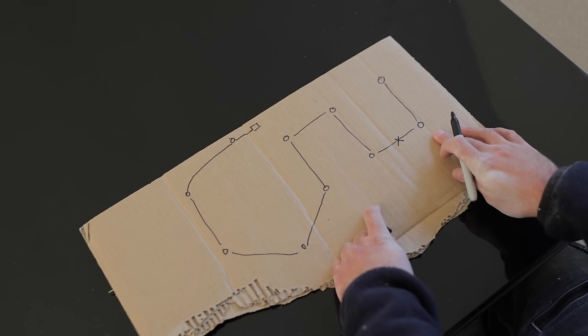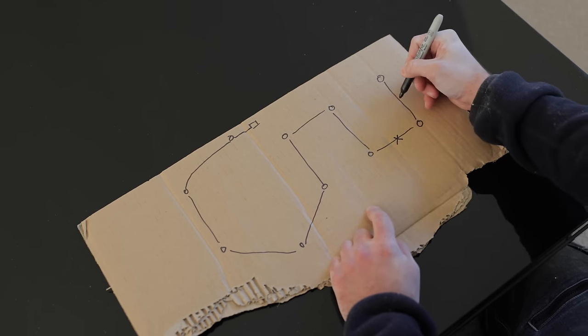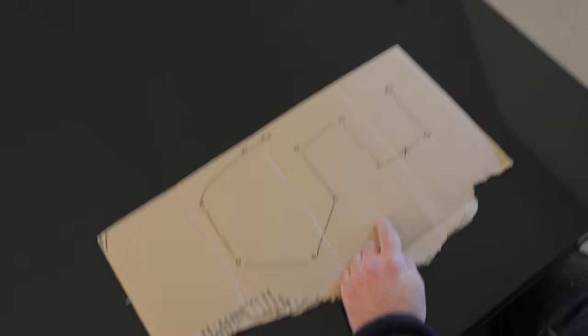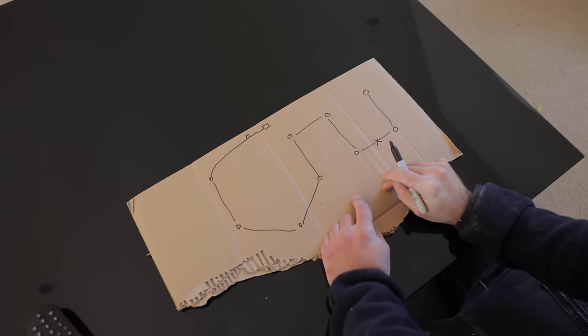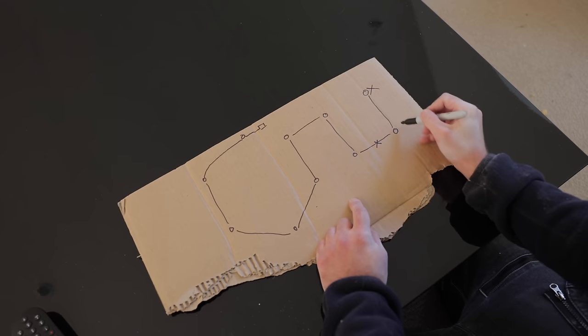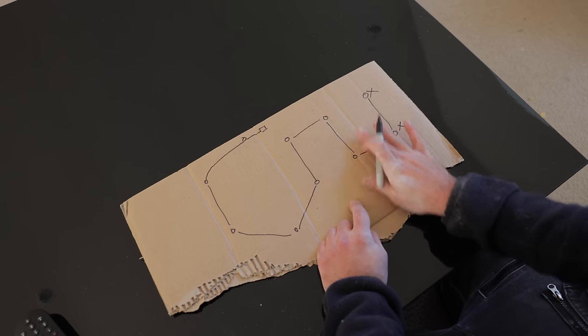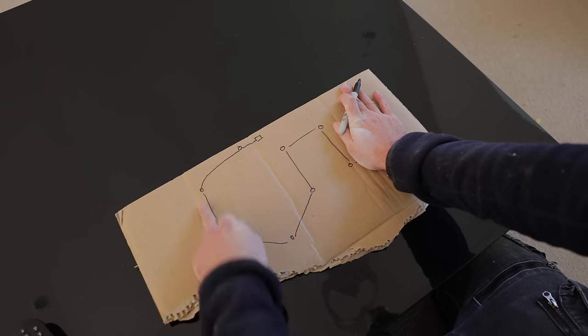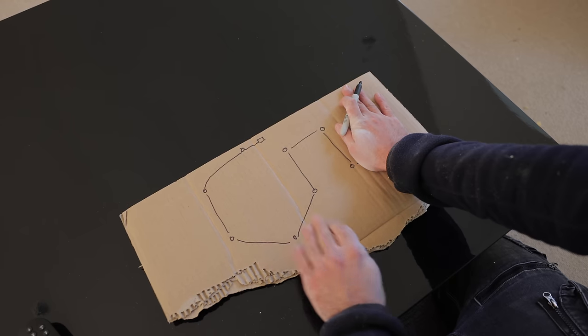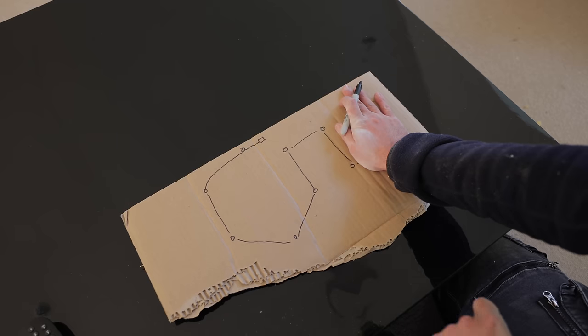Unfortunately, due to the way these are wired, the cables actually go up to the middle of the pitch ceiling and across. If you look at the lights, it's full of Celotex and it's all clipped. So I can't actually break it to pull in a new piece of cable there. So for now, I'm gonna have to have these lights completely disconnected. And so the circuit's only gonna go up to here. So we're just gonna have these lights on and then that's the fault repaired in here. However, I still have the fault next door, so we'll have a look at that now.